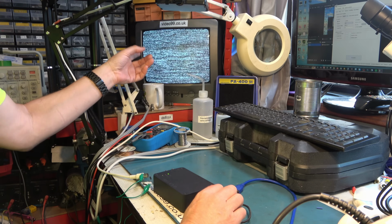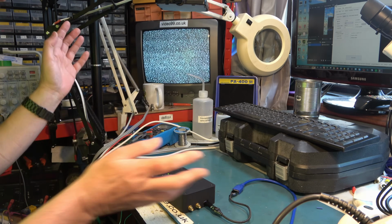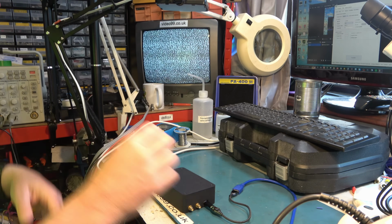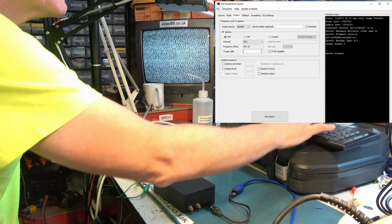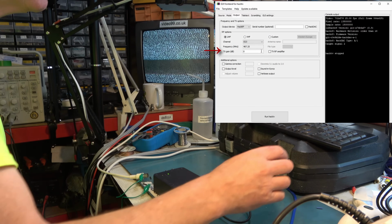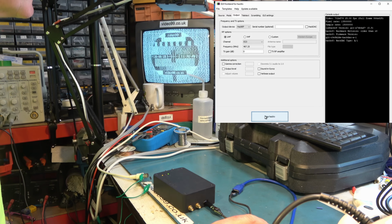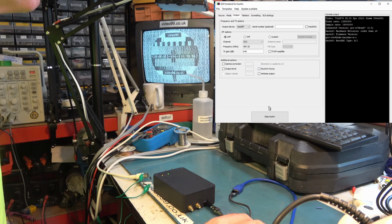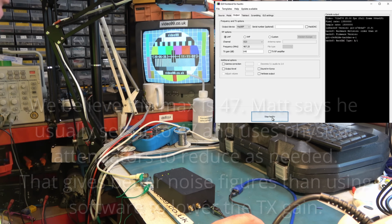I don't know if you can see it, but there's a certain amount of noise, so I think this radiates noise across the UHF band, which is a little bit untidy, but okay. Now initially I had set a parameter here, TX gain, to 0 and ran it and got a very noisy picture, very low gain. I messed about with the gain and put in a value of about 45 dB and ran that, and I get a nice clean signal.